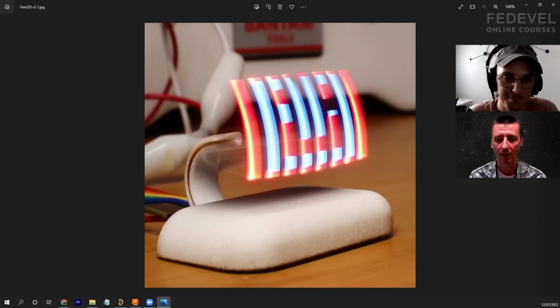I know, for example, when you are designing the part of the flex which is going to bend, and there is, I don't know, a right angle, then you should maybe use a rounded corner or something like this. Exactly. There are some guidelines that can help you, for example, for the bending radius, how to calculate the radius and not to make sharp corners. For example, you can also hatch the copper planes to make it more flexible. There are some tips like these you can find on the internet.